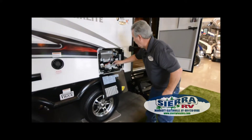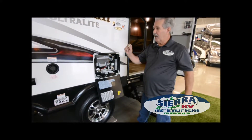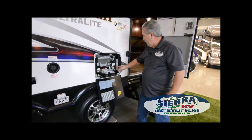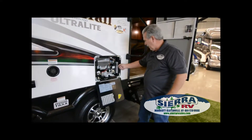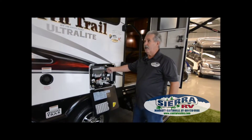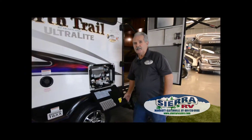Hot water heater is right here. This one does have the aluminum tank, so it only has a plastic plug — you don't need an anode rod when they have an aluminum tank. The biggest problem people have with these is getting spiders or bees in the tube. If that ever happens, get a piece of wire and just rake them out of there. Never open the pressure release valve. When you're filling the water heater, you can open one of the hot water faucets inside, but you need that air space on top.